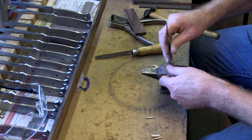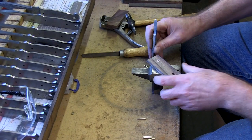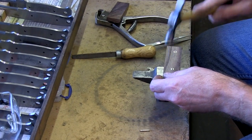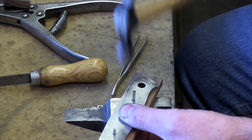The wood is riveted onto the handle blanks, 3mm nickel wire and 2 brass washers. We think this gives a particularly great fastening to it. You don't affect the wood, you pin everything together and it produces a nice strong handle.